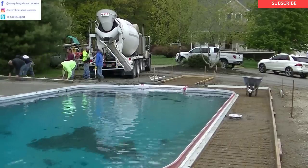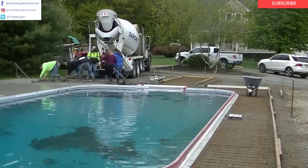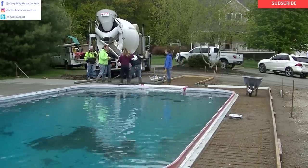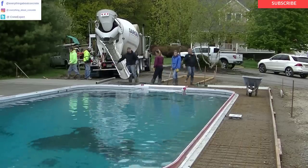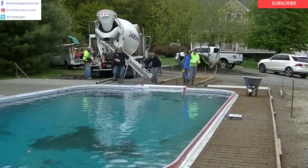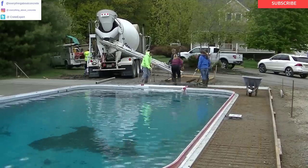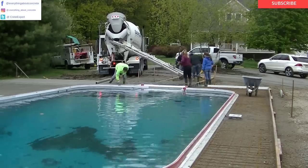You've got to be really fussy when pouring a pool deck — there's only one chance to get this right, and it doesn't pay to go back and fix anything. We hustle when we pour but we're not trying to hurry. We want to make sure all the pitches are right and everything looks really good, especially with those inside forms — you want to make sure they don't move and everything's nice and straight. You've got Darren there running the chute pulling the wire up as we go. We didn't put anything under the wire to hold it up because we had to back the concrete truck across it and we're going to wheelbarrow across it too. We'll pull it up as we go. We also have fiber mesh in the concrete, so there's fiber reinforcement plus the wire mesh — two reinforcements in here.